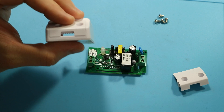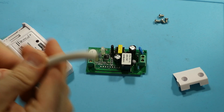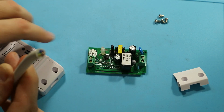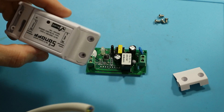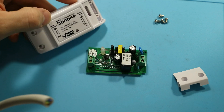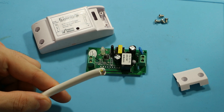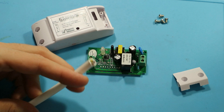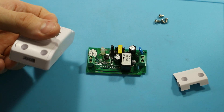If you take a look at a cable, normally you will have a thick cable like this with three wires, and it won't really fit. Why do you need cable of this thickness? Simply because it has been proven and documented that these devices can indeed handle 10 amps, but most people use cables which can't. So if you don't want to burn your stuff, use a proper cable rated for 10 amps — and that cable will just be too thick for this enclosure.